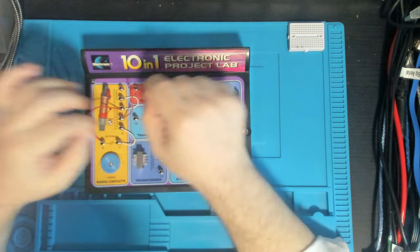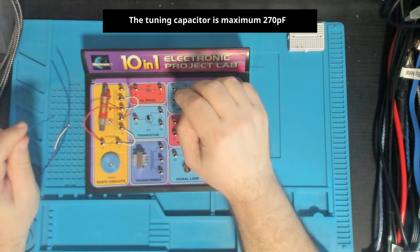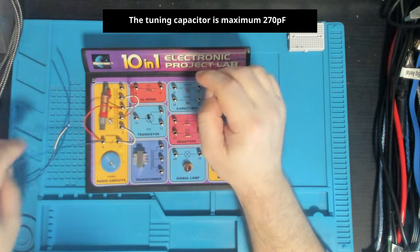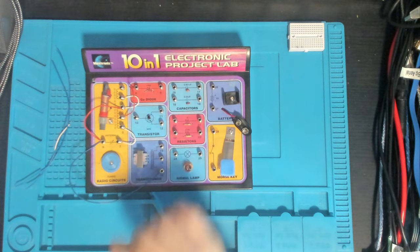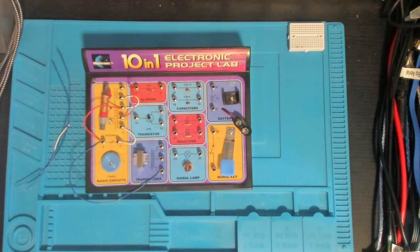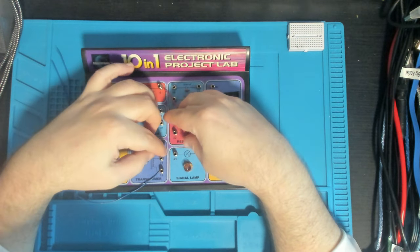I did actually do some measurements of that tuning capacitor, but we might have a look at that again later on the bench. Then we've got six to 15 — we'll need a fairly long blue cable for that. That's just wiring in the transformer, which has something to do with the output circuitry. And nine to 13 — that's the germanium diode over to the transformer.